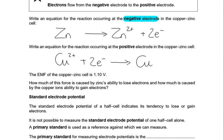Now, your typical AA battery is 1.5 volts, so we're looking a little bit short of that typical battery. What we need to understand to be able to find the best battery is how much of that force was caused by zinc's ability to lose electrons and push them away from itself, and how much was caused by copper's ability to pull electrons towards itself. It's a difference between their two abilities, a potential difference. So we need to know how much of that was due to copper and how much was due to zinc, and then pull that together in order to find different combinations that give us the voltage we want. This idea is called the standard electrode potential, which we're going to address in the next video.